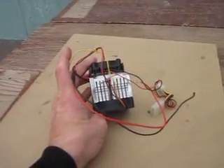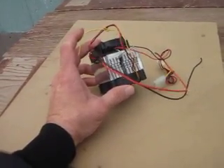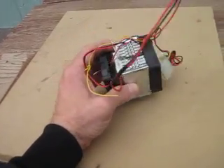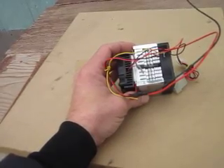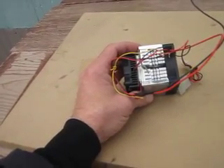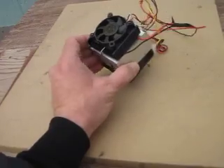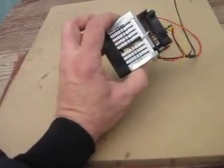See that white plate? That's a peltier. I've seen a lot of people use these and they're not really doing things following any kind of method. I found that this particular one — I'll try to leave a link in the description — runs at max 16 volts, max 4 amps. Now if you run it at 16 volts at 4 amps, it's going to burn up, because that's the absolute high-end max. I have found that you have to regulate both voltage and amperage. Just keep that in mind when you're dealing with these.